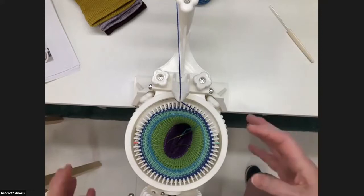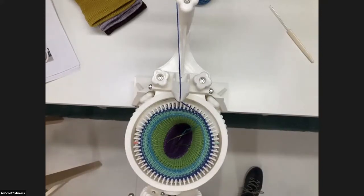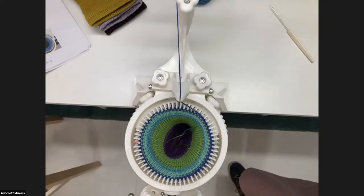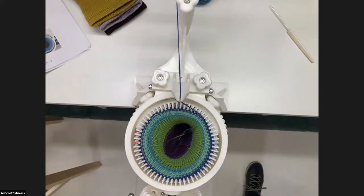As I say, the plastic is very durable. We haven't had any problems with it at all. It should last as long as a metal machine, as long as you take care of it. You will have to clean the machine like you would with any regular sock machine. We don't recommend using oil on the machine. We recommend using a spray, which is an anti-friction dry PTFE lubricant, and it sprays on wet and then you let it dry. The good thing about the spray is that you could actually spray the cylinder slots as well as the track bed and the cams.